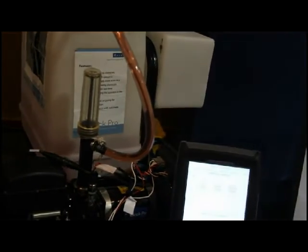What I'd like to talk to you about today is our injection system and our pump flush system that goes with it. We realize out there that there's a real need for when we're pumping different chemicals through a system — some of the chemicals will change their characteristics if the weather gets cold. Others are the type of chemical that if you use them, they should be agitated; if they're allowed to settle, they're probably going to settle into the moving parts of the pump.